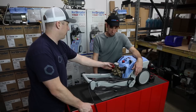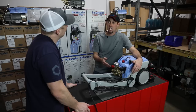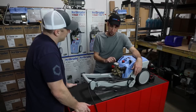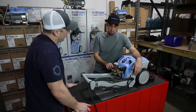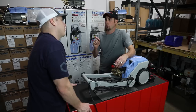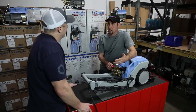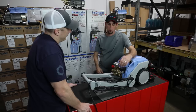Let's say I have a 4.2-size factory nozzle and I want to run 500 PSI — am I damaging the pump long-term by unloading some pressure? No. That's the purpose and intent of this device. The Germans recommend turning the unloader valve handle fully counterclockwise to drop pressure down to almost zero. But it's important to point out: it's doing that by decreasing flow as well as pressure. For washing cars, we want as much flow as we can get. When you increase the orifice size instead, you're decreasing restriction and dropping pressure while retaining the full flow of the motor.